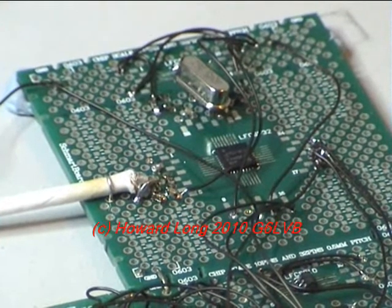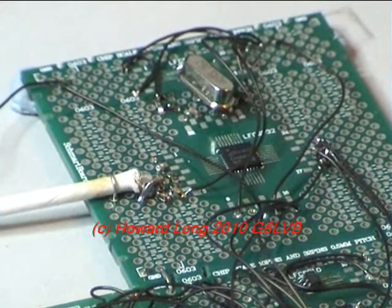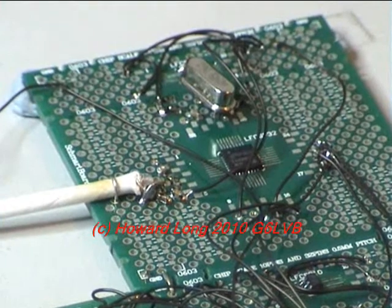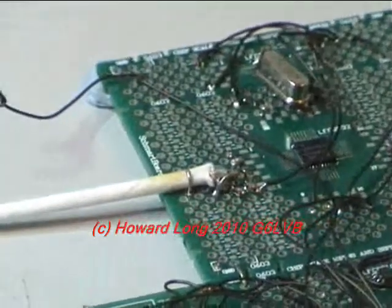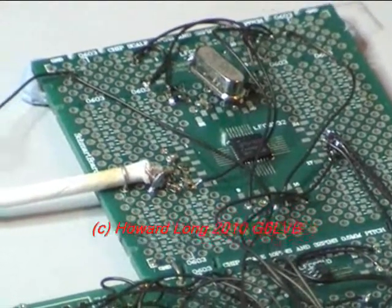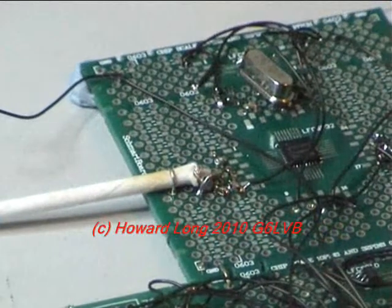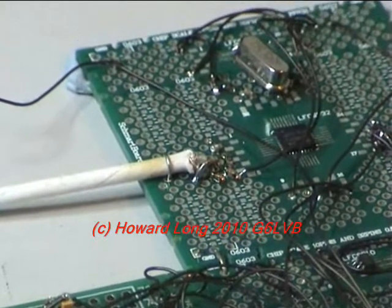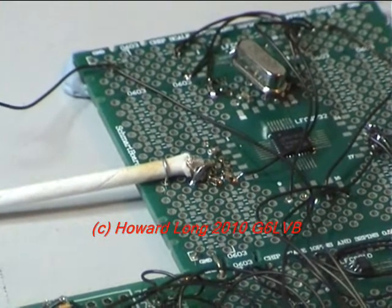You'll find a number of the components are actually underneath the board — you can see the crystal there — to keep a nice close path to the chip itself and to the ground plane underneath. You might think: okay, there's the end of the RF cable and there's the chip that converts to baseband — what is there between them? I can tell you it's simply a one nanofarad AC coupling capacitor. That's all. There is no external LNA on this device; it's straight RF straight into one of the pins, and it gives you baseband out.